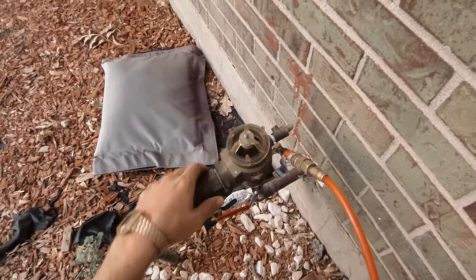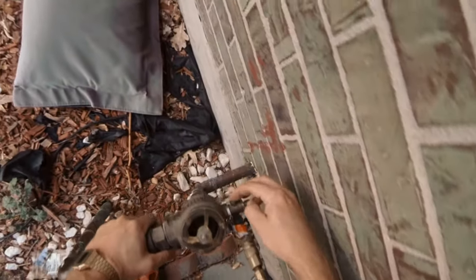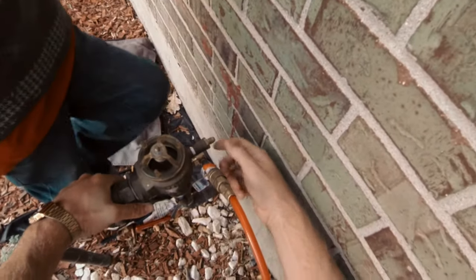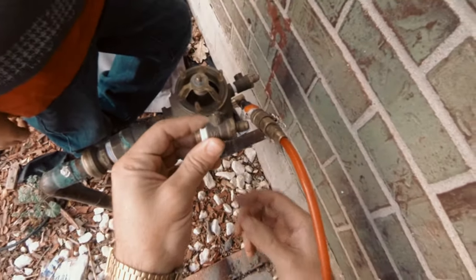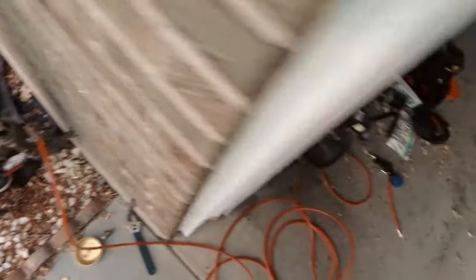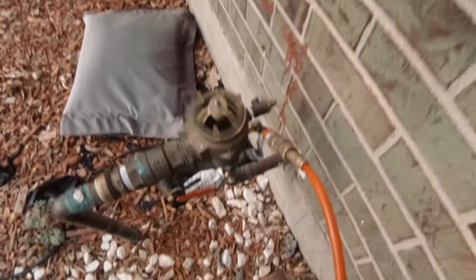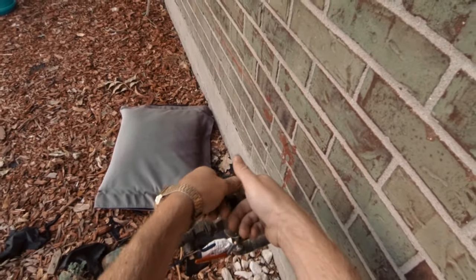You could leave this open if you want, but it's better to close it — more pressure into your sprinklers. You can use these valves to put a connection to an air compressor. I have to take mine off because I don't have enough room, so I just take off this whole thing and put my own fitting in there. I've got it down there tight and hooked it up to a six-gallon air compressor at about 125 psi. I took off the top because this little valve was staying down and it wouldn't come up and seal.